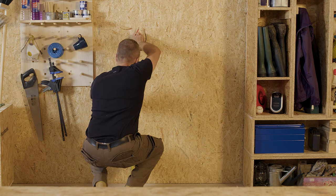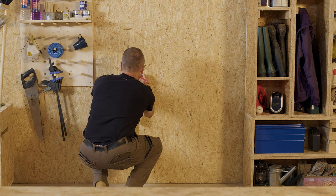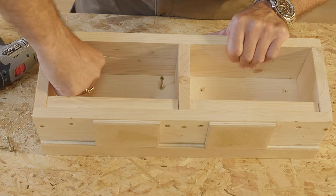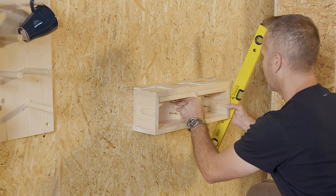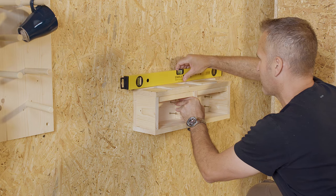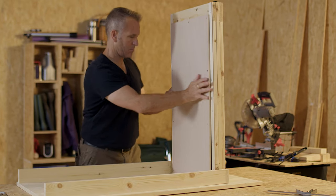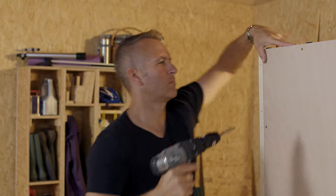Wherever you decide to position your table, measure up and make sure that there's enough room. To get the height for your bracket box position, measure the length of the drop-down leg plus the feet, then measure this height from the floor and make a mark. Use a spirit level to scribe a horizontal line along your mark. Twist the screws in partially on the back of your bracket box, hold it in position, check that it's level, and then screw it into place. Now take the blackboard, hold it in position in the frame, drill your pilot holes, countersink, and fix it into place with screws.